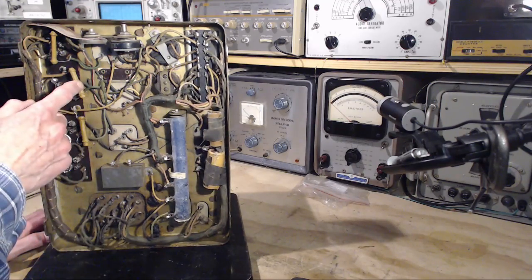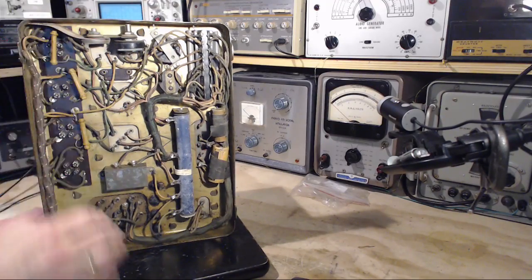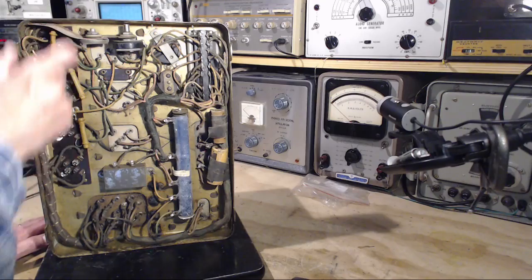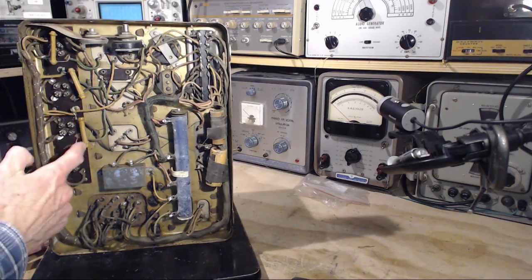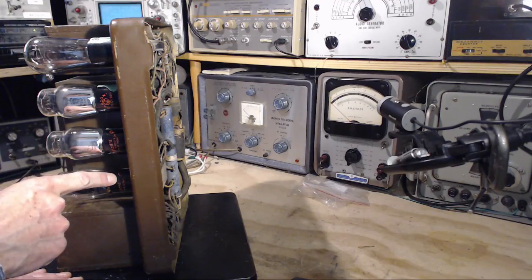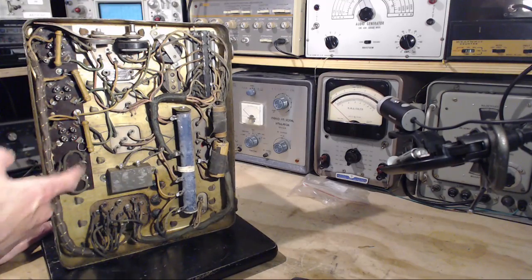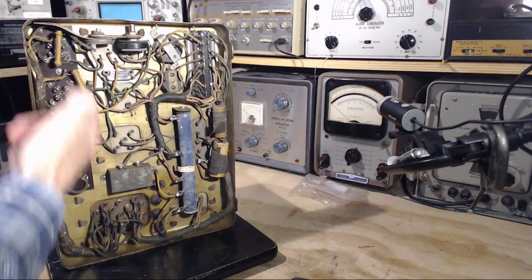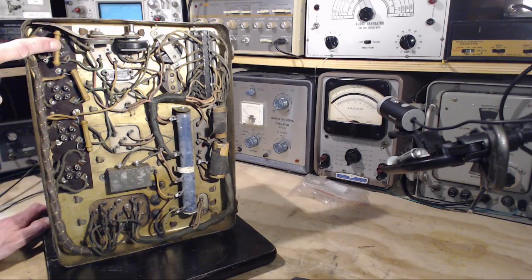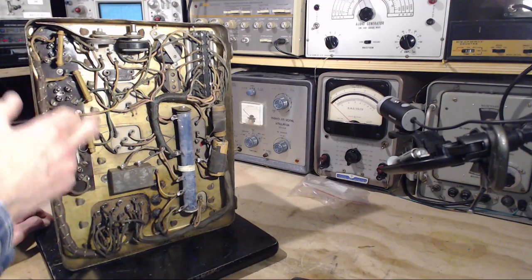I gotta be just a little more certain about what these resistors are here. You know what I'm thinking? I'm looking at the radio, and there's a series of 26 tubes. So you'd see the same, but no, that's not what's happening here. There's 2 output tubes, a preamp tube, and a rectifier tube. The rectifier tube is not really part of this grouping, no resistor. It's doing something completely different from these guys, which are all amplifiers. So the signal starts here, gets boosted, and then it's fed into these 2 in push-pull. So these resistors are on the output. Oh, that's what it is.